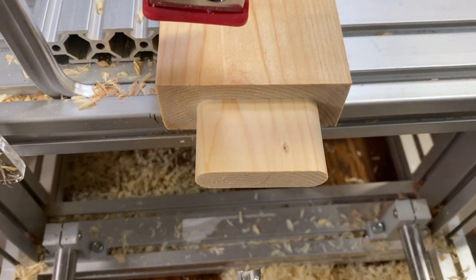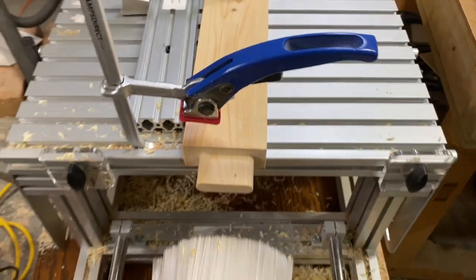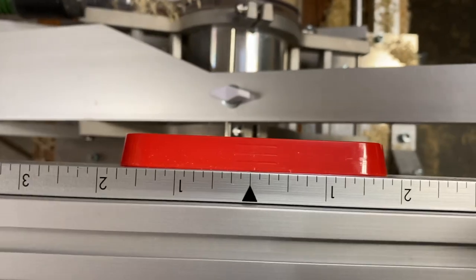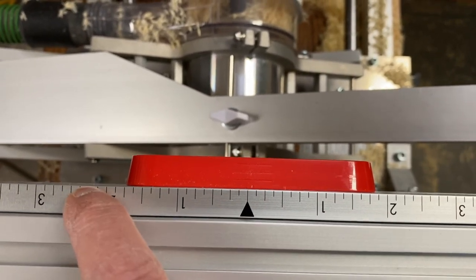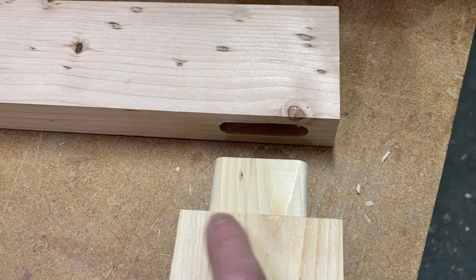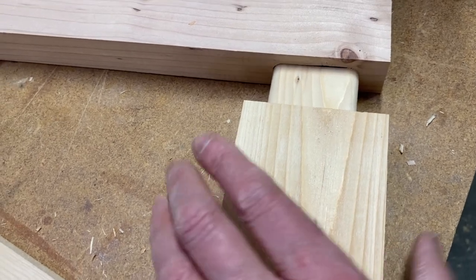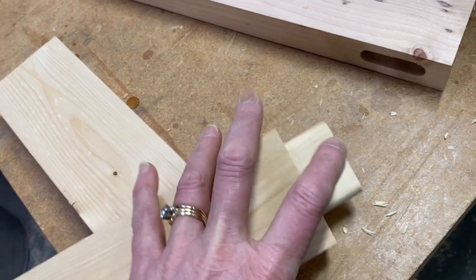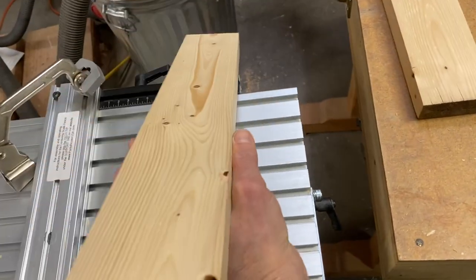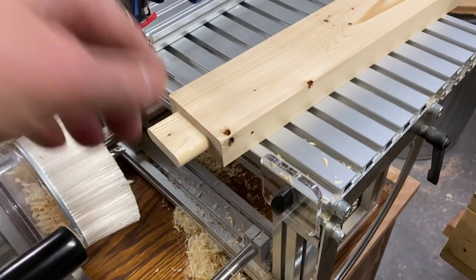I have a confession to make. I realized after I did the first tenon that it's not actually centered, and I could have seen that quite easily if I had just looked at where I had things lined up. This edge over here hangs a little bit farther over than this edge. If I now move things to center, it wouldn't work - the tenons would be centered in my cross pieces. I can still line them up; I just have to be careful to ensure that I have the same wide end up against the fence. I need to go end for end on the table so that I have the same wide end. It's still centered vertically because of the thickness of the board.